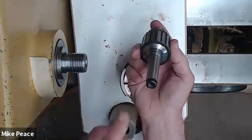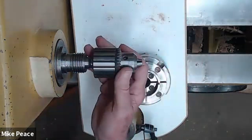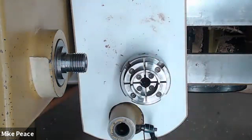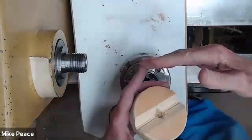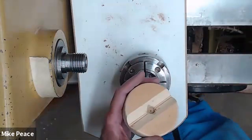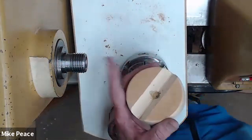Here's a golden goose. It's threaded for, I think, 1/4 inch by 20. So you put a drawbar to hold it. It keeps it from vibrating out. But anyway, that's one way you could drill. You put the drill bit on there and you bring your tailstock and bring the work up like a tool handle into that spinning drill.